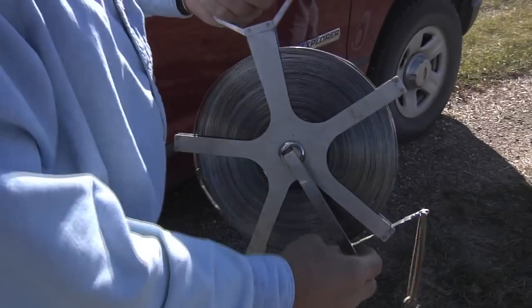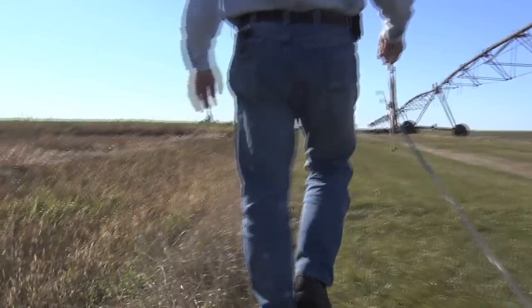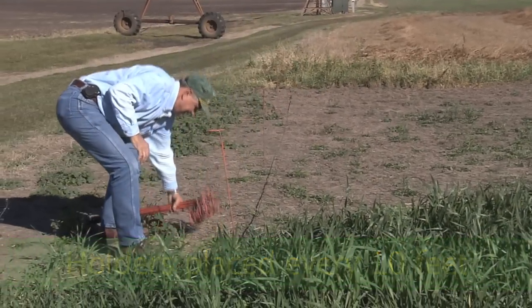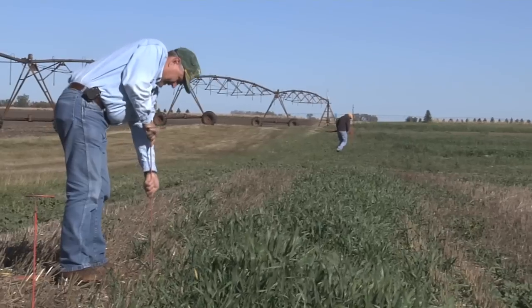This is an old metal surveying tape. If you pull it out, you'll see there are red marks on there — we painted those marks every 10 feet. Once we lay this on the ground, we can just walk along, find the red mark, and put the holder there. That way we know precisely how far from the pivot point the cans are located.